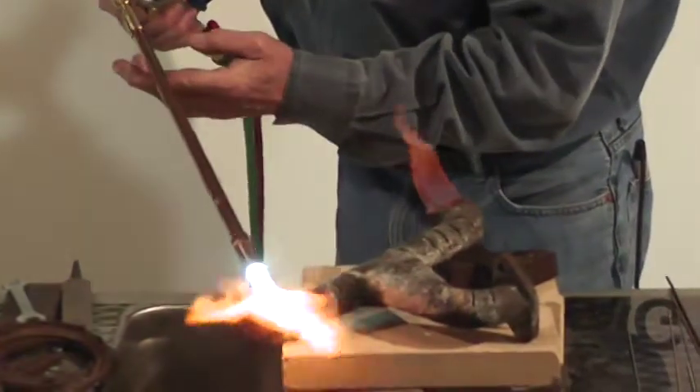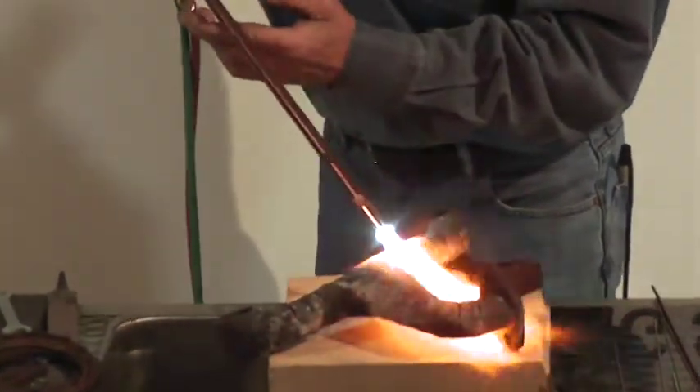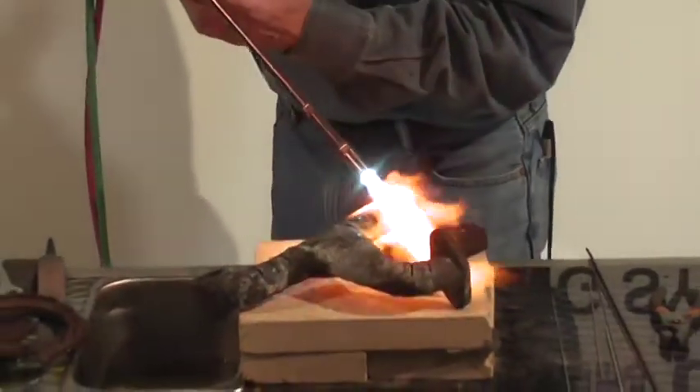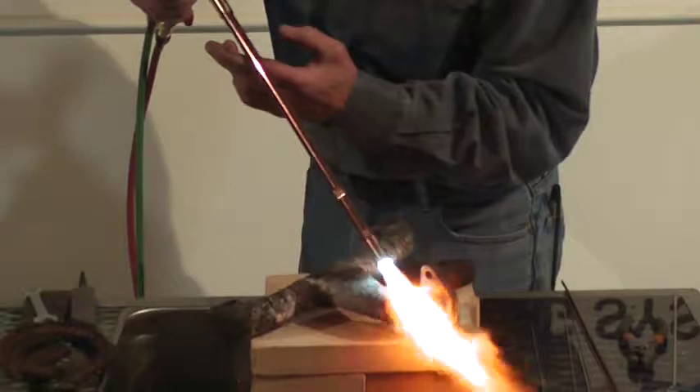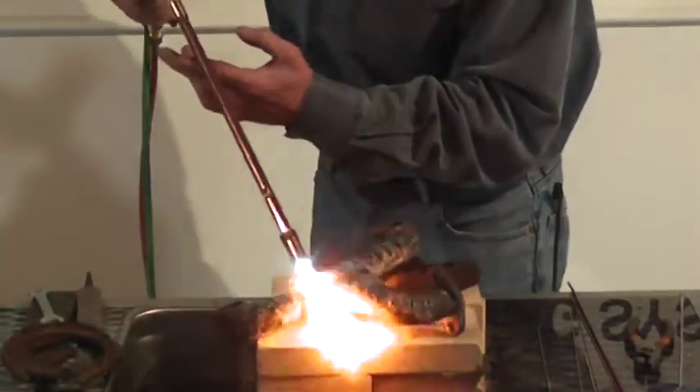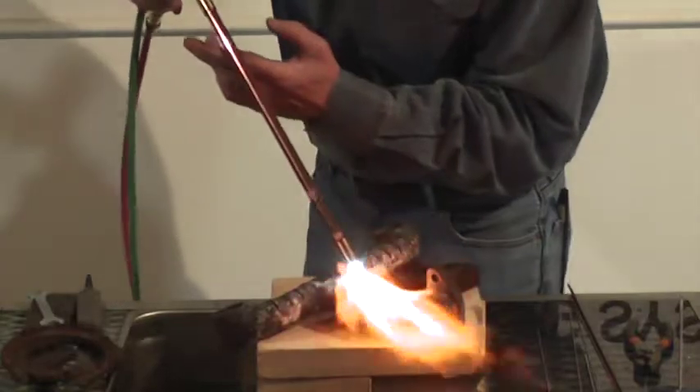Is that sweet or what? So if you guys want to do some heating on some larger pieces of material, that spreads out extremely nice. For cast, you're going to preheat it about 300-400 degrees. Doesn't make a difference how dirty it is.